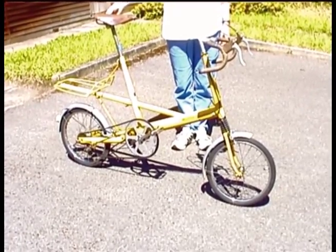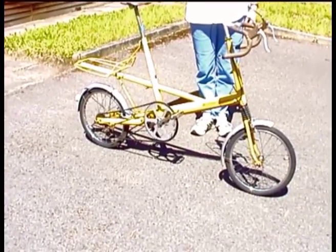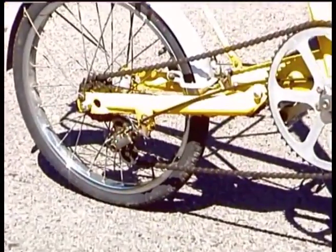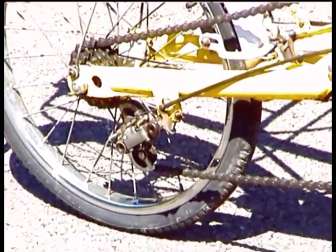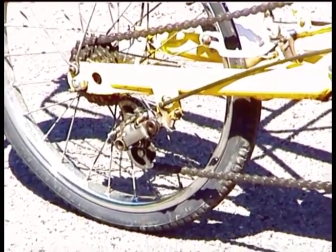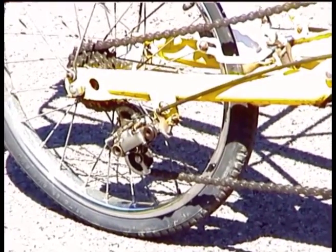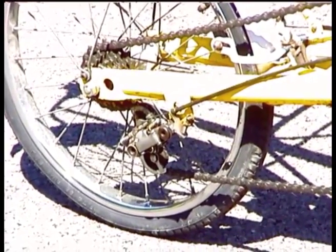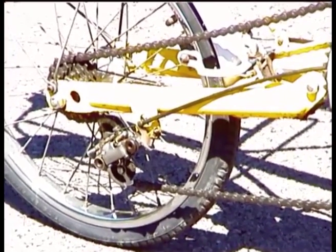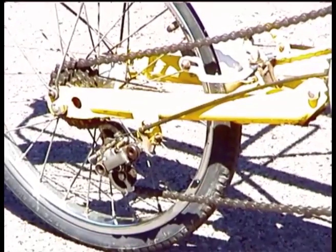It's got a Series 2 rear suspension, and if we have a closer look at that, you can see something rather unusual about the derailleur, in as much that it's mounted ahead of the rear axle. Not totally unique, but quite unusual. And this is in fact a specially modified by Moulton Cyclo P2 derailleur with a 6-speed block. Very much the cutting edge of derailleur design at that time.